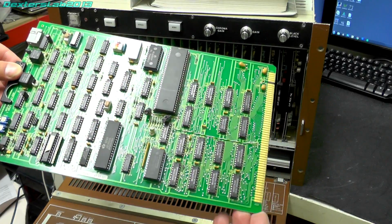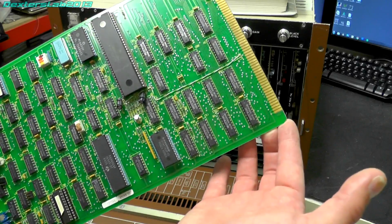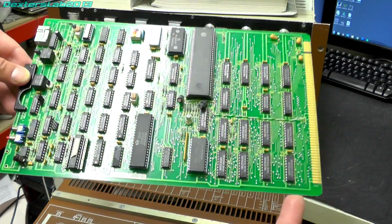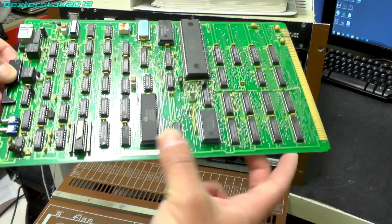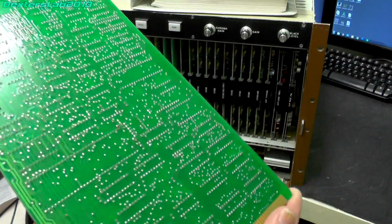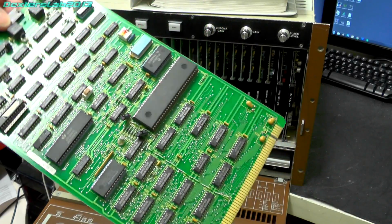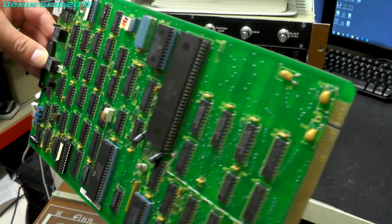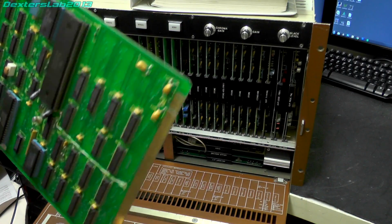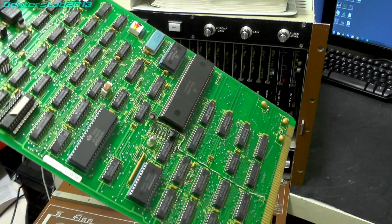So this, as you can see, there's mostly just 7400 series logic. There is a 68000 running on there, the main processor, which controls the whole system. So there's a couple of peripheral devices on there. Now there are some modifications that have been done to this by Retro Gamer VX. He swapped out a number of the tantalum caps, these evil devices on the end, these things here. They have a tendency to go bang, so he's replaced these with some electrolytics.